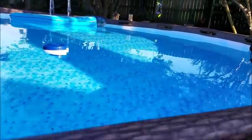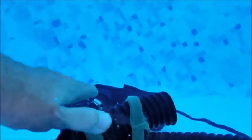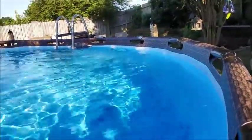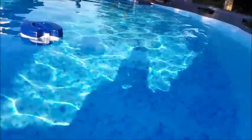So when we are not in here, I added this. Not everybody will have the opportunity to do this, or if you want to do it, you go to your local hardware store. This is a pump that I've added. It doesn't have a filter on it, it's just pumping water. This one is a little big. It's 5,000 gallons an hour. As you can see, it's really moving the water. Now, I placed it in a position to where it's constantly moving water around this pool. That's very important. If you think about a cyclonic event, if it was shaped like a tornado, all of your light particulates would go up to the surface towards the edge. They would spin off over here towards the edge, and your heavier particles would all fall down in the center of the pool. Now, that makes it very easy for us to clean. Now, we don't use this all the time. When we're in it, all I got to do is take it out and set it on the ground and put it back in.